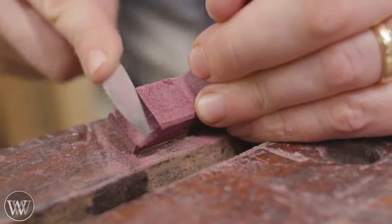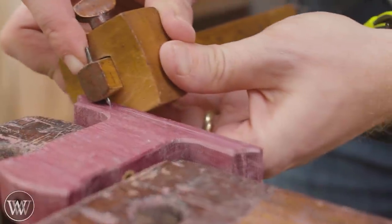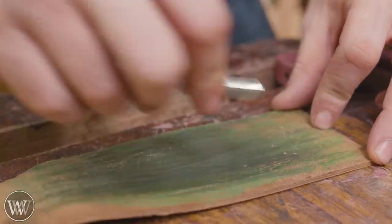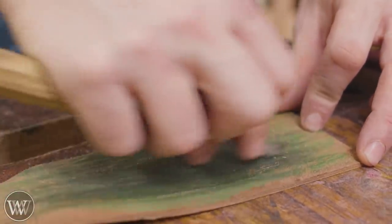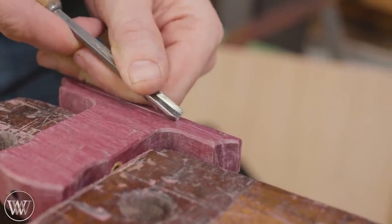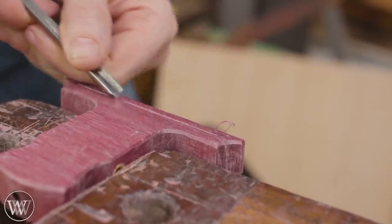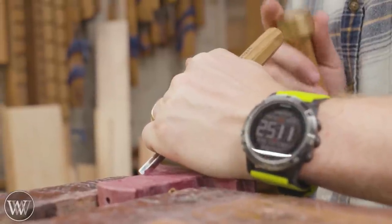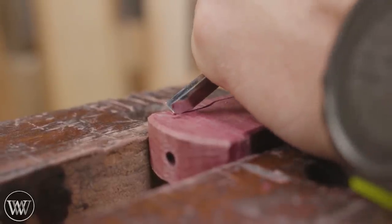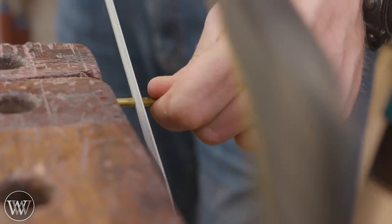We're going to chamfer this side, clean that all up, and then I thought let's do a little bit of carving. I decided to do a marking gauge line running all around and do a fine v-groove. I had a little bit of time left over so this was just five or six minutes. I put a marking gauge on the bottom to measure in, and then for the rest of it I just eyeballed the outside edge of the v-tool and kept that the same distance away from the outside, free-handing this all the way around. I was very happy with how this came out.